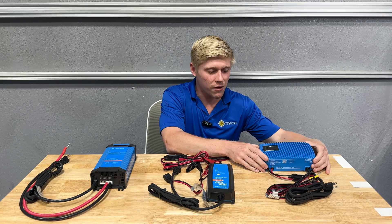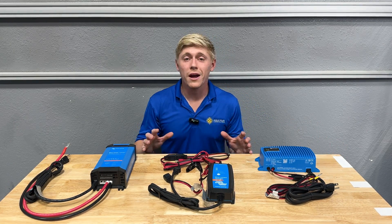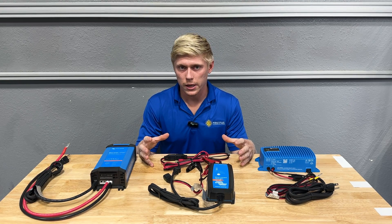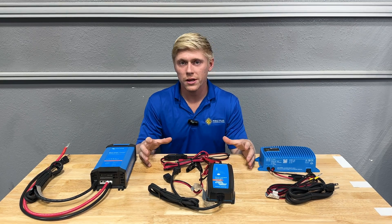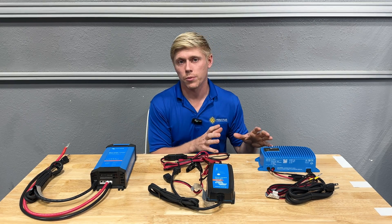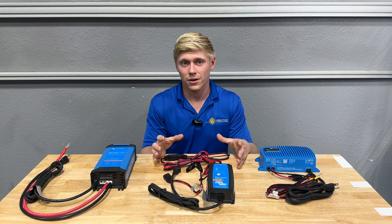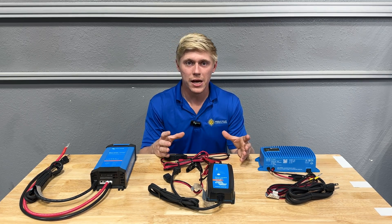The IP67, being as rugged as it is, does not have buttons on the face — you'd have to do that through the app. A very important feature I want to highlight is the dead battery recovery function. Tons of chargers are on the market, but the reason you need a Victron Blue Smart charger is because if your lithium battery goes into what's called protection mode, it's going to have no output at the terminals. Most chargers are going to see nothing, but these chargers are going to try to revive a dead lithium battery — similar to jump-starting a car, but a little more complicated when there's a battery management system involved.